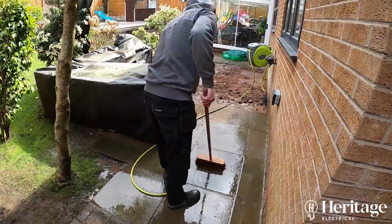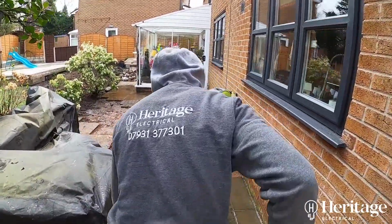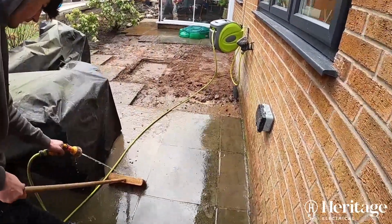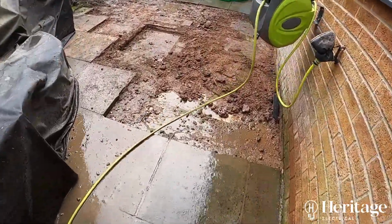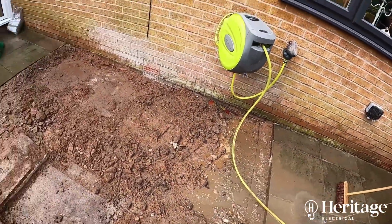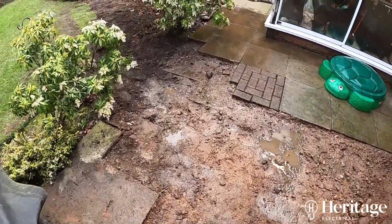And finally, it's taken about 2.5 days to excavate the hole to the required depth, install the cable, sand, cement, barrier tape, backfill it with the materials that came out, and that will be ready for the consumer unit, and then on to supply any current using equipment they're going to have in their summer house.